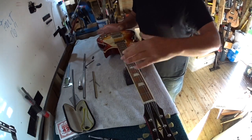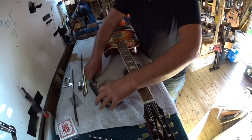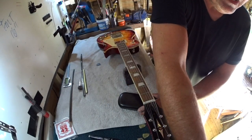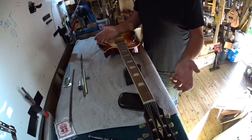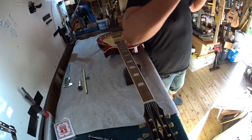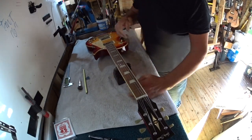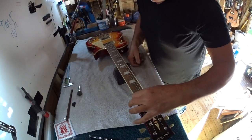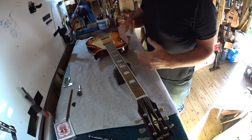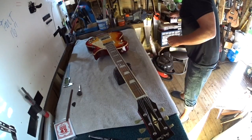So that combination of curvature and the compression, if you level with the compression you've dialed in, if you like, and in play while you're leveling, what you basically get is a relative levelness now, which will change a bit when I take the strings off, but when I load it back on with new strings, those frets will all go back into the same relative levelness in relation to each other, which includes the variation caused by the longitudinal compression. And that isn't the case with other methods, so I'm pleased about that aspect too. It's not the be all and end all, but it's just a kind of bonus that you get with the method.